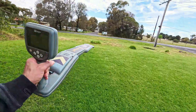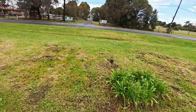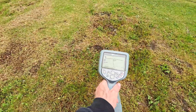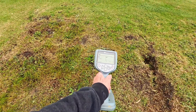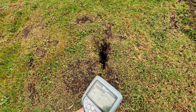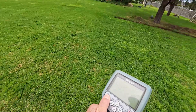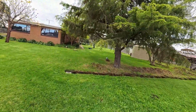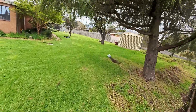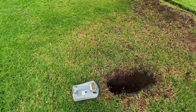For those that haven't seen the video, I've already dug down and exposed where it is, so I know exactly where it is — it's right there. So we're at 200 kilohertz. Let's run through and show you. There you go — trace wire broken in that hole just there, and yet I can still locate it through, using a Radio Detection locator rather than a Vivax locator.